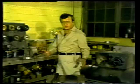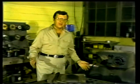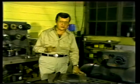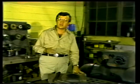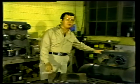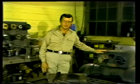The work area, of course, must be grounded. For a fixed welding machine, this is usually done by grounding the welding machine to the building. In this way, the welding process can be safely accomplished. Now, for a portable machine, the leads are connected to the work.